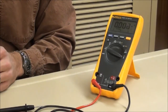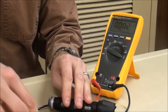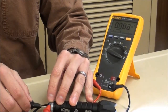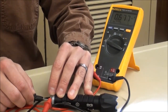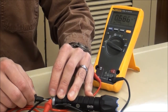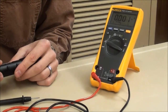We'll do it one more time with our M60-based option — this is a three-cell model with our 235-lumen Malkoff M60 LED module. Do the same thing: positive on the threads, negative engaging the negative terminal. Here we see we only draw 0.6 amps, which is one of the reasons M60-based flashlights have such outstanding run times. We're drawing less than 0.7 amps, so we get extremely good run time, and we are at less than half of the maximum current draw allowable from these batteries.